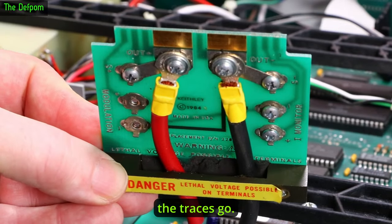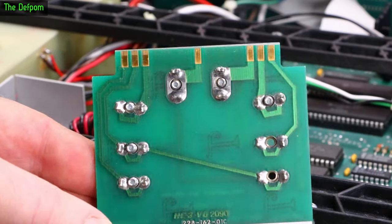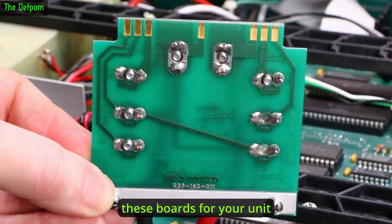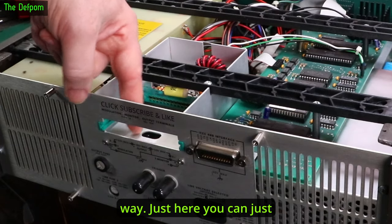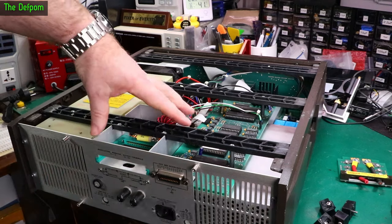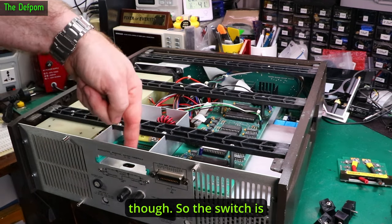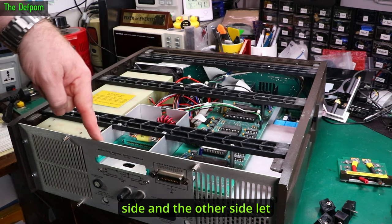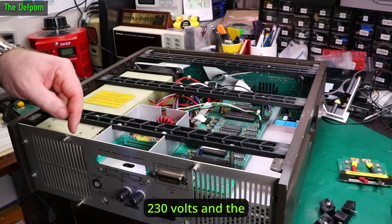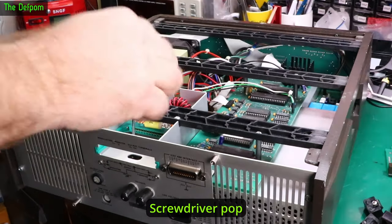If I try and get the light on it right, you can see through it and see where the traces go. If you don't have one of these boards for your unit, maybe you can replicate it from this. You can just see that slot there — that slot is directly above the switch for the voltage selection. So instead of having to take all this assembly out, you can go through that slot. The switch is directly below it. On the PCB it's marked 230 volts on one side; that side says 115 volts, this side says 230 volts. The switch is currently in the 115V direction, so I need to stick something down there and pop the switch over the other way to make it 230 volt. Pop the switch over — that should now be on 230 volt.